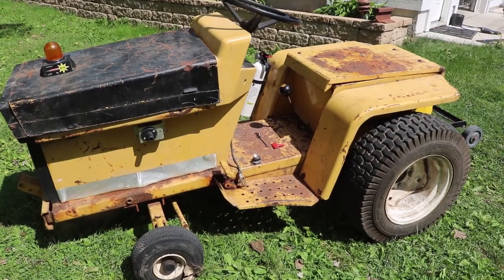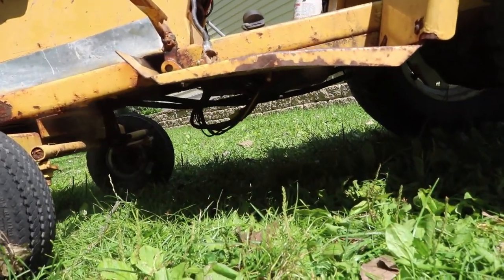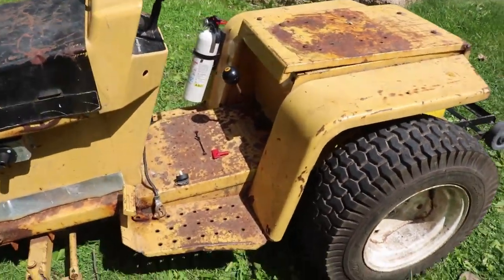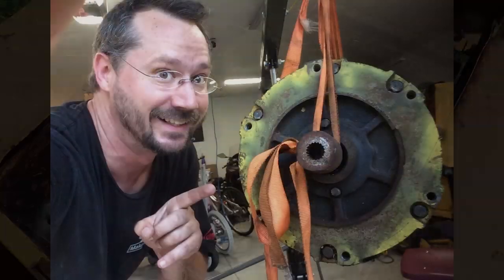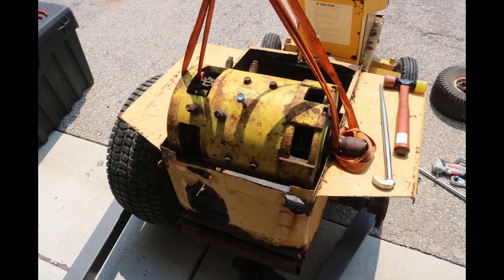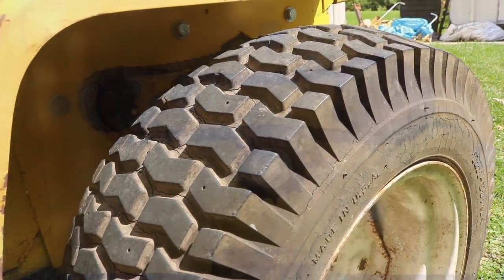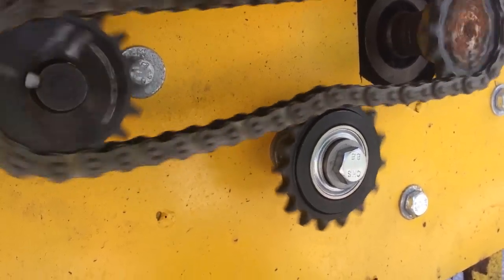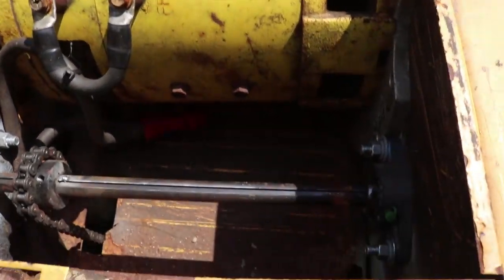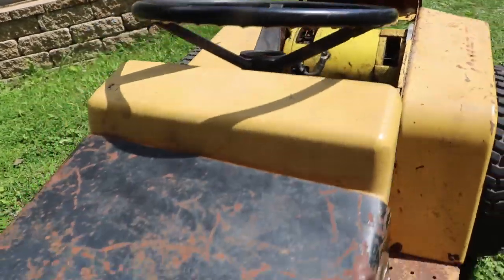Kind of the big overview: normally one of these tractors would have had a motor below right in the middle, but this did not have a motor — nothing was there. I did have a big forklift motor originally from my Geo Metro electric car project. That motor exactly fits under the seat, except of course there's no room for the drive shaft, so I actually brought that to the outside of the fender. I have a sprocket from the motor to a chain up to the front, and then inside I have a jack shaft that crosses over to another sprocket and chain, which goes down underneath to a sprocket on the transmission.